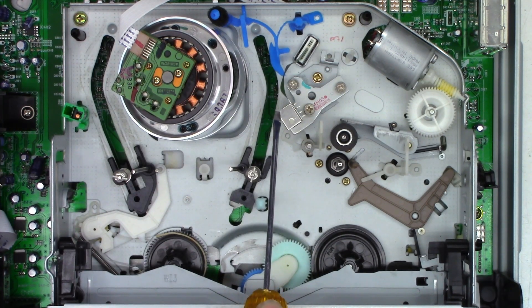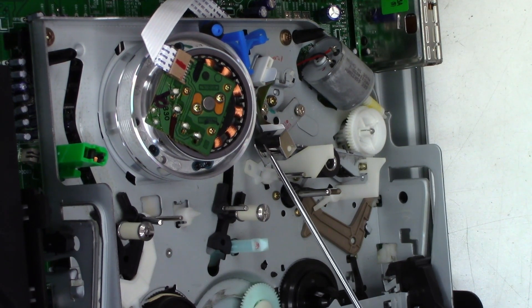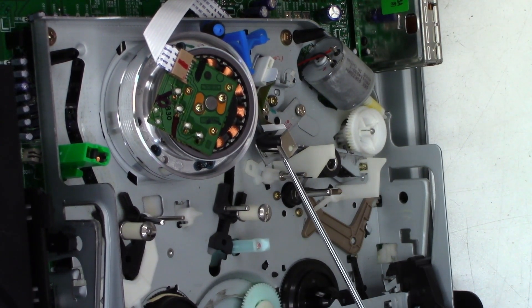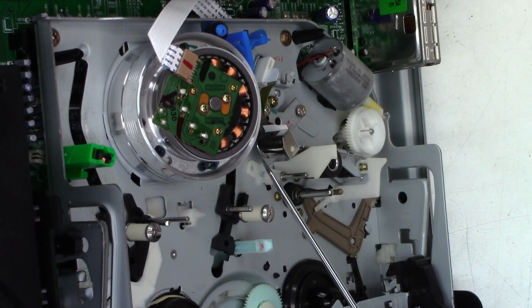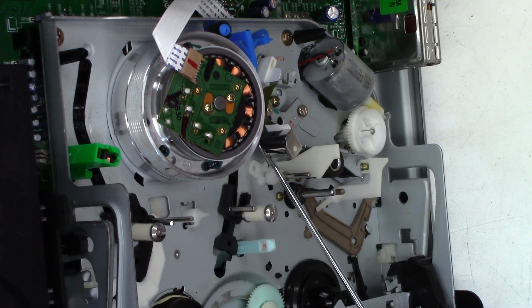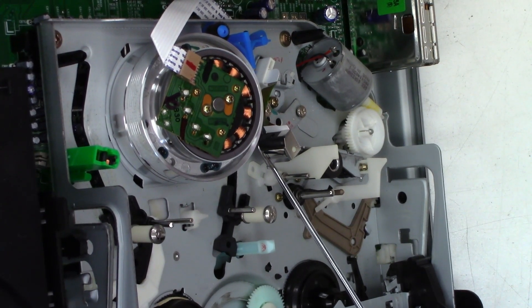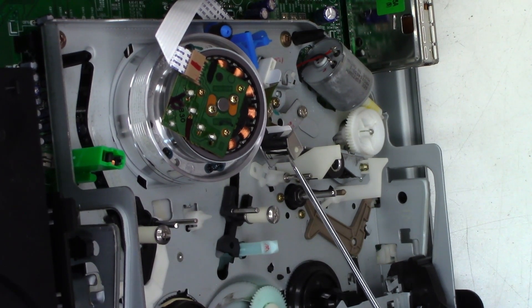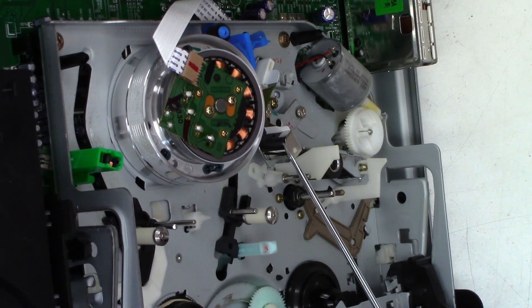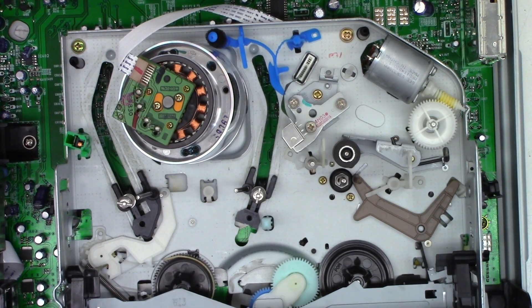The black portion right here is the audio erase head, so it erases just the top of the tape where the audio track is recorded. Down here is the control head that records a vertical sync pulse onto the tape to adjust the tracking, and up on top you can barely see it — that is the audio playback and record head.